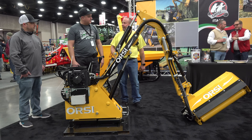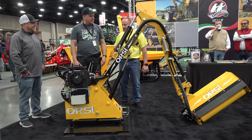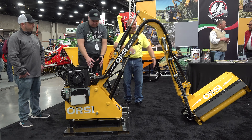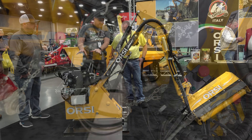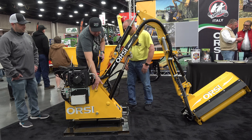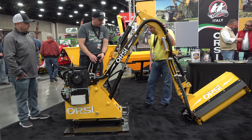The height spec wasn't confirmed, but probably about 10 feet as well since it works in a radius - four or five feet here and four or five feet there. What we see here is a joystick. The hydraulics are all contained in this unit - it's not depending on any of the tractor hydraulics at all. It's driven by a PTO hydraulic pump, and this is the actual reservoir right in there.